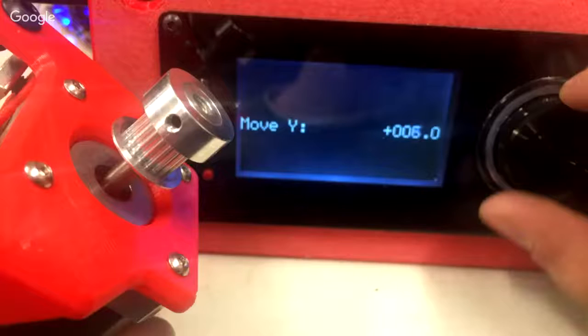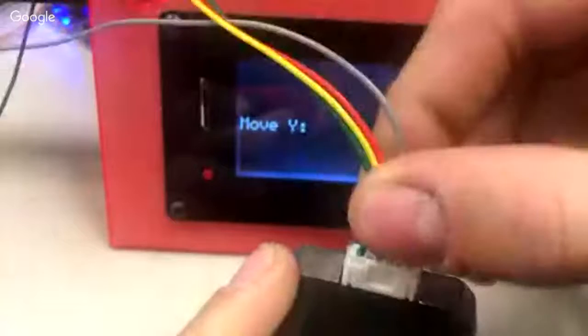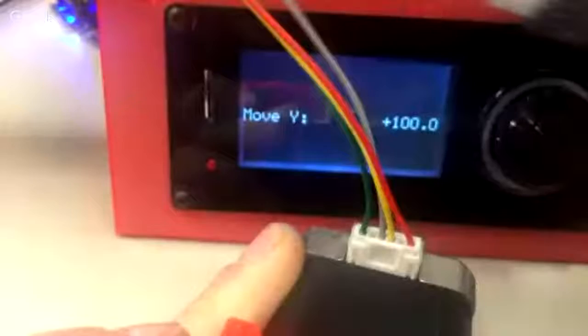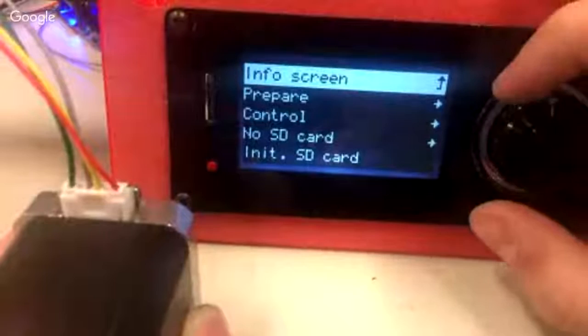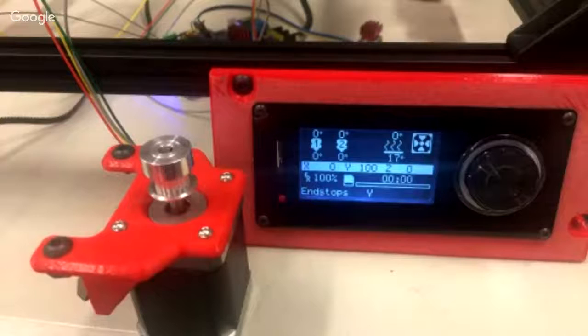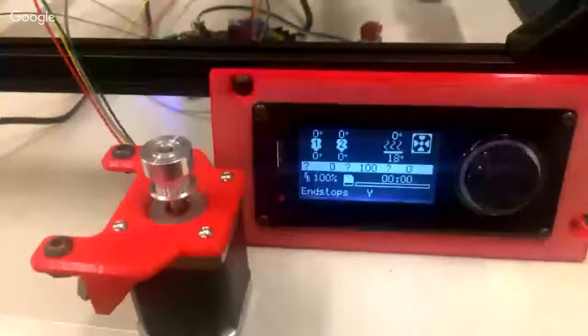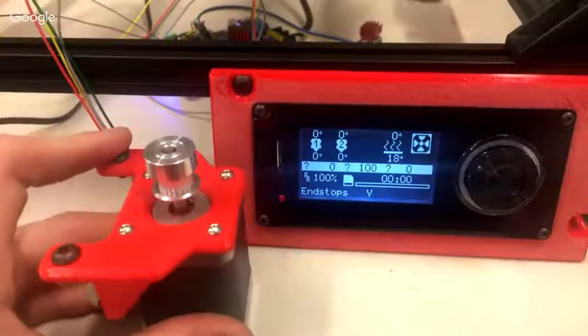And you checked the inductance across your wires and made sure? Yeah, I'm using the cables from Robot Dig as well. Yeah, it's just, you know, some people's cables and things like that. The only thing I do, if you can fit a multimeter down into that little space before it's going into the motor, just make sure, as the pinout says on the board, for the one coil and the next, that you're actually reading conductivity across that coil. You can either measure in ohms, or if you've got a multimeter with the audible sound, just make sure, because I had one time where I wired it up wrong myself, and it would go in one direction just fine, but backwards it would step funny.